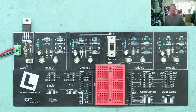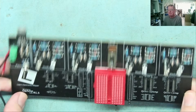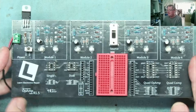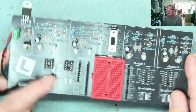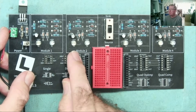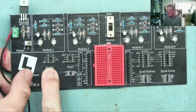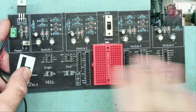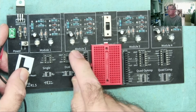I'm going to link these various projects here — the ones which we've built ourselves and tested. You might be interested in some of these. This is the Omnis Op Amp Tester. This tests single, dual, quad op amps, and also comparators. You can actually test surface mount ones as well. You can plug DIL ICs in here. With the SMDs, you just hold them against the board, press with your finger, and the LEDs flash to show you if they're working.